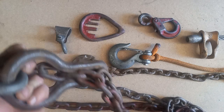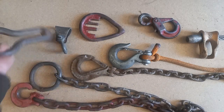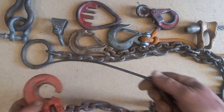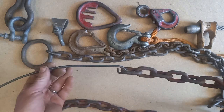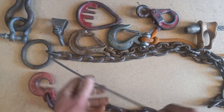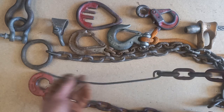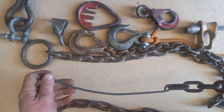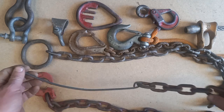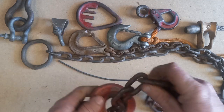This is a really predominant system in the northeast where guys like to use choker chains. There are a lot of people that love them and a lot that hate them. Let's look at the different styles. This one I made — a little hard steel piece from my scrap pile, painted red — so you can shove it underneath the log and reach around the other side to get it. I probably would have made these a little longer; the longer they are, the more convenient for getting under the tree.